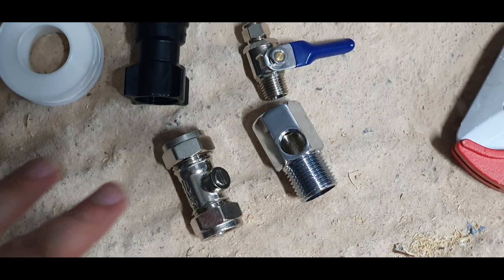I've fitted and tested the RO fittings here — it's all connected up to my 15mm pipe. This is a bit backwards: normally you'd have the valve before the tap, which would allow you to shut off the pressure and remove the whole system should you want to. I've actually done it the other way around because this is where I wanted the tap to be.